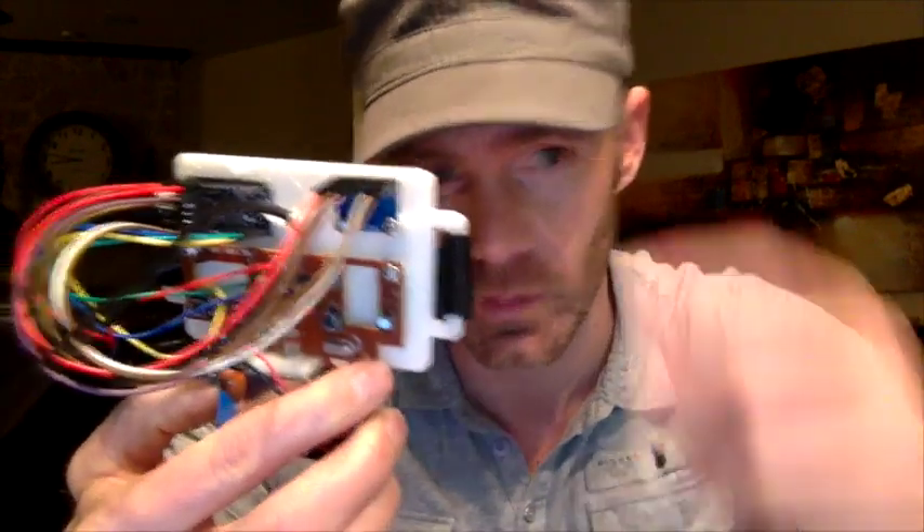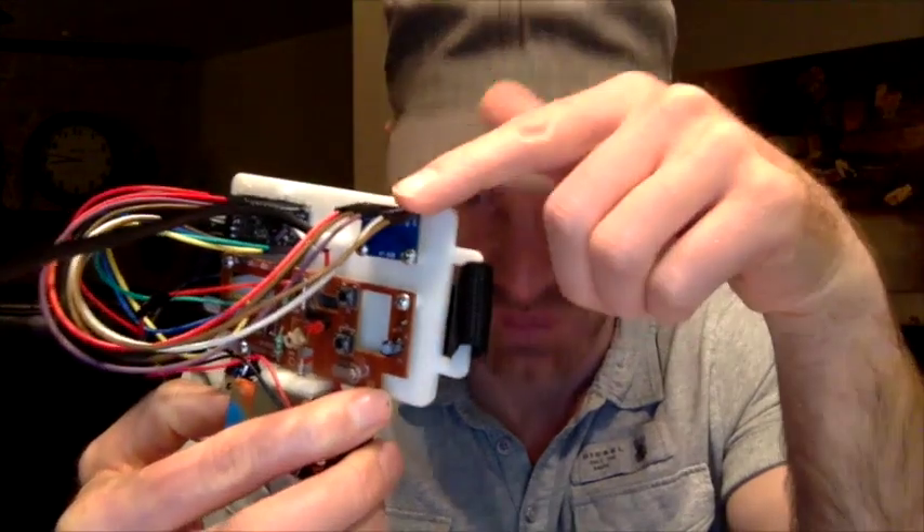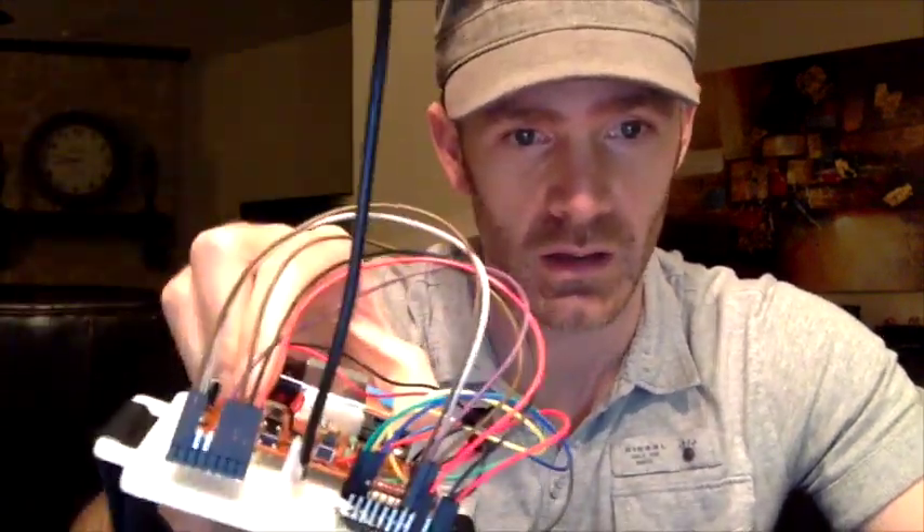So we tied on an Arduino mini Pro and then we tied on a gyroscope accelerometer. I 3D printed this little nifty platform for it all to mount up to, and from there I put a 9-volt battery holder to give power to the RF board that was actually from the transceiver itself.